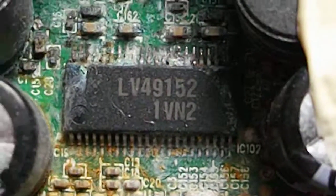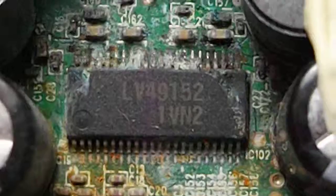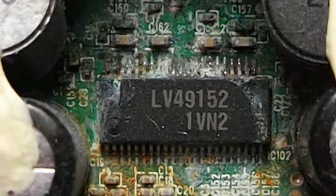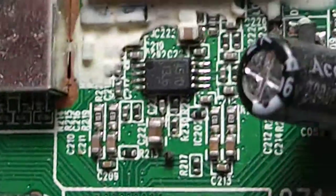It might be possible to find this chip, but that's micro-soldering — to desolder and re-solder that is going to take a long time. You can tell right there the legs are broken off, corroded and rusted away. Originally there was a capacitor there, and even in that area there are SMD micro resistors that are corroded away. Who knows if it even works. If I find this board I can replace it all.